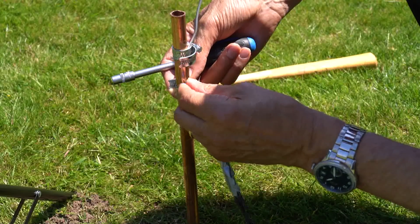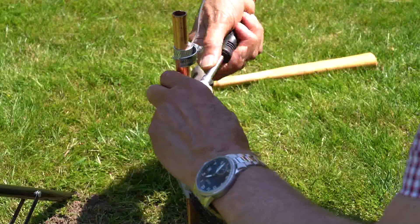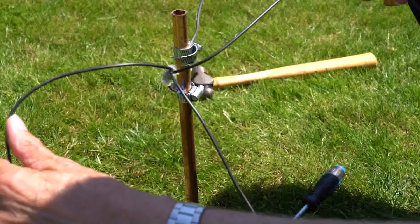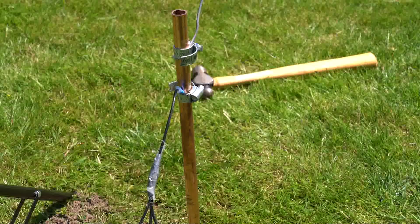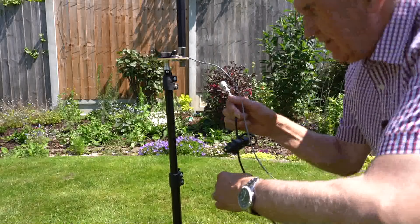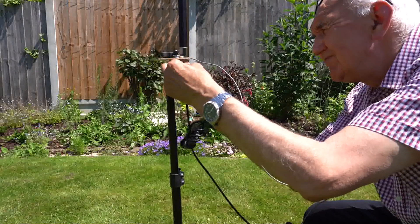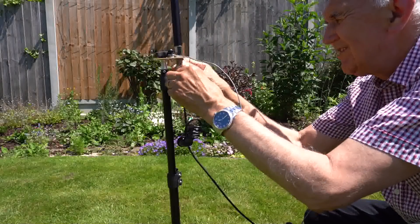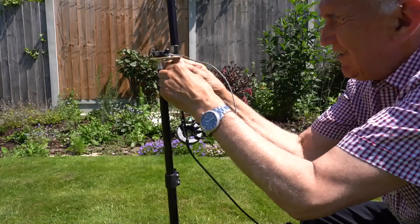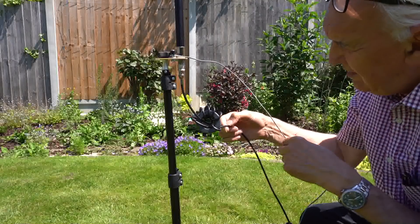It's best to pre-assemble the radials and solder them so that you've got just one connection to make. In this case I've used three radials, connecting them to the copper pipe. Remember to lay them out in the same way, the same pattern in the field as you do at home. Now the final task is to connect the coax feeder. I've used a ferrite toroid — this is 43 mix, two-and-a-half inches diameter, with around 10 or 11 turns of coax around the circumference. I can't emphasize too much that this is quite an important component of the system. It makes it much more stable and you get a better match and certainly greater stability.